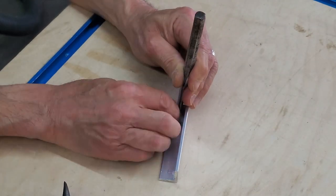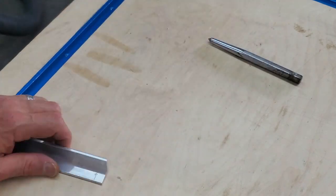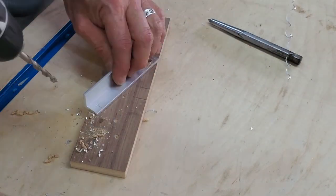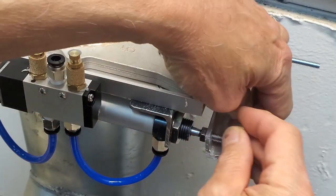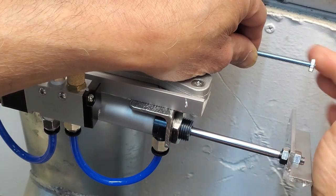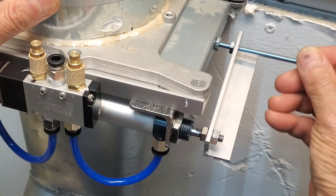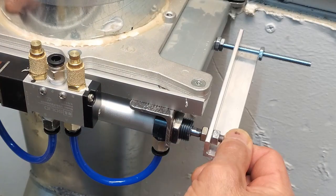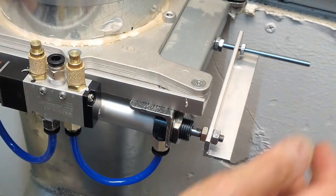I'm using some three-quarter-by-three-quarter-inch aluminum angle for this linkage piece. I'm mounting the link rigidly to the actuating rod and oversized the hole on the other end of the link a little so there's some play on the rod attached to the blast gate. I'm also setting the nuts on that rod to allow some back-and-forth play. That allows for any difference in the travel lengths of the pneumatic cylinder and the blast gate, and the momentum of the gate carries it to fully open or closed when it operates.